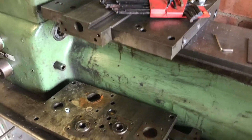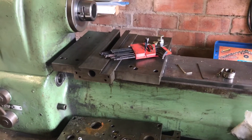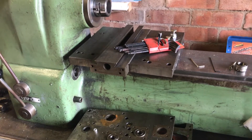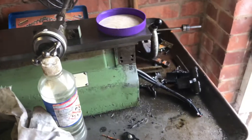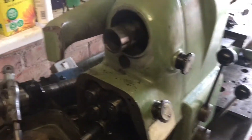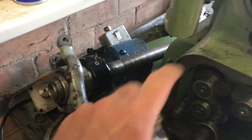Taking the apron to pieces — this machine had gears in the apron driven by an electric motor mounted on the carriage, and that was used for taking your cuts, so the gearbox was only ever used for screw cutting. I removed the variable transformer from the end — you can see the wires there — and now we're starting to take it to pieces at the back. This Delrin handle went on there and that's the collet closing mechanism that slides in for the 5C collet.